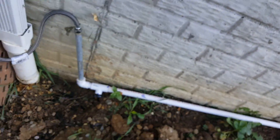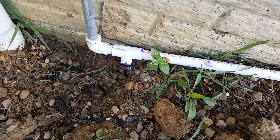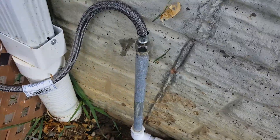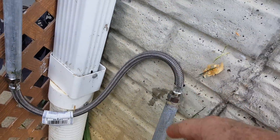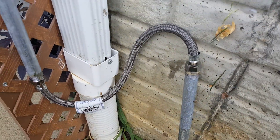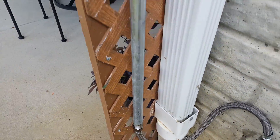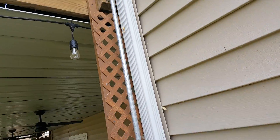When you turn the water off in fall, all the water drains out of the pipe so there's nothing left in it. Then when fall hits, you can just easily unscrew this stainless braided hose from each end, take it inside, and put a cap on the end of your galvanized pipe.